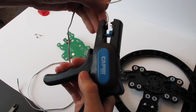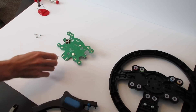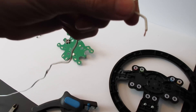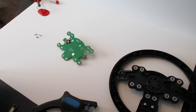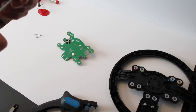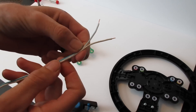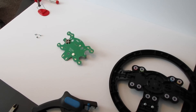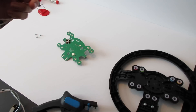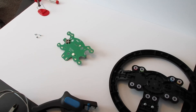Strip just one end for now. You don't need to strip very far — at most a quarter inch of wire exposed — because you don't have much to solder to and you don't want wire touching anything else. As far as positive and negative go, it doesn't really matter since the button just makes contact, but I like to keep track. This wire has a blue line, so I'll call that my negative and keep it consistent.